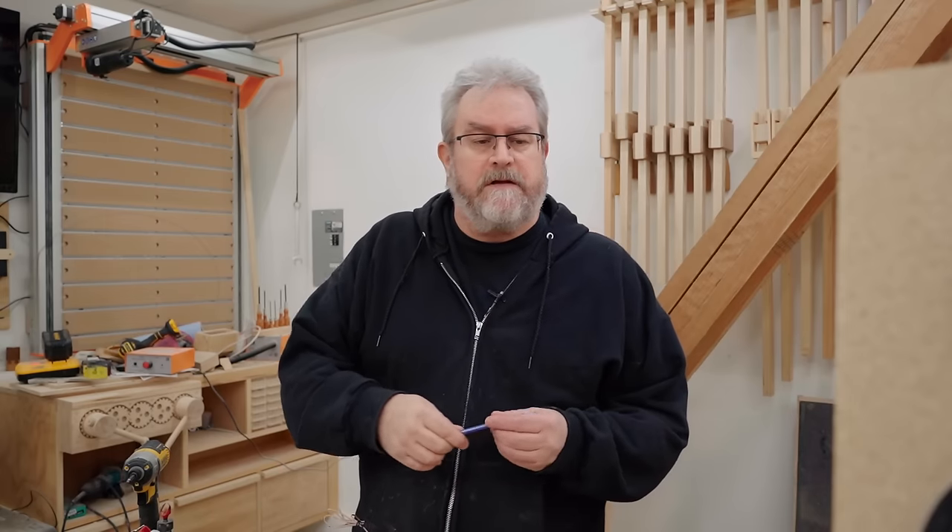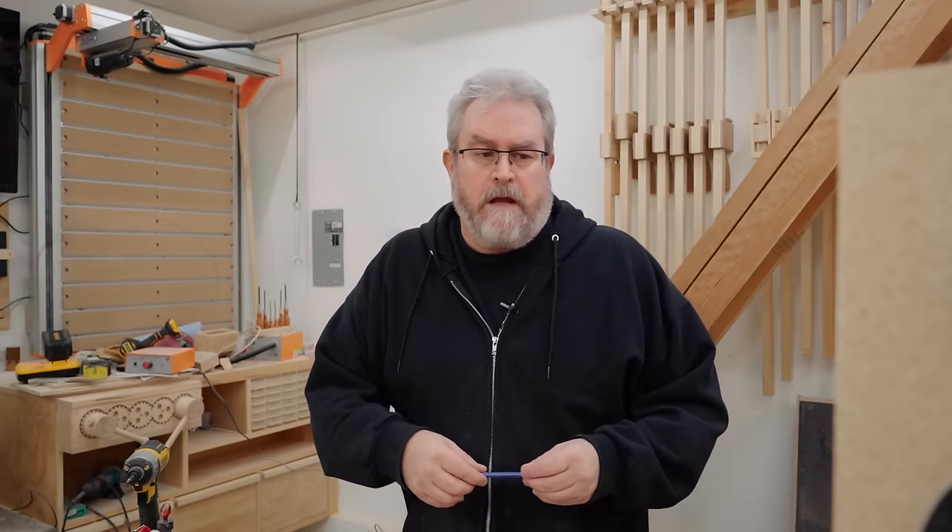It's not actually a dirty little secret. It's well known to people that make, design, or build open baffle speakers. It's what's known as the dipole peak, and it has a big effect on the response you're going to get, especially in the lower frequencies and right up into the upper mid range.